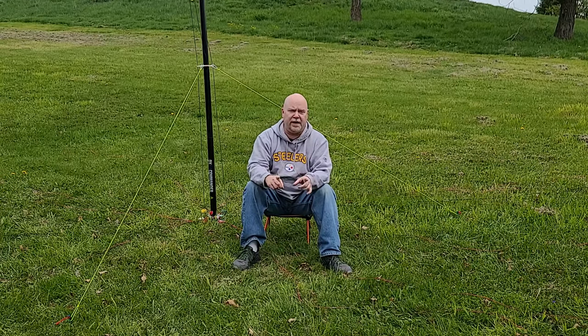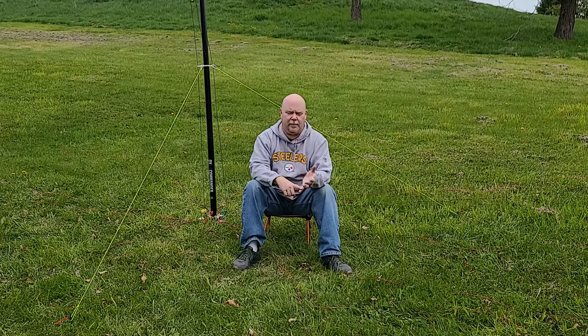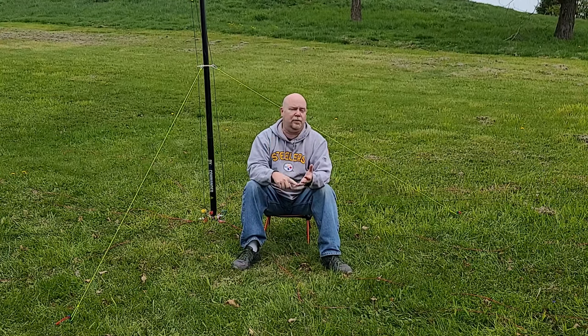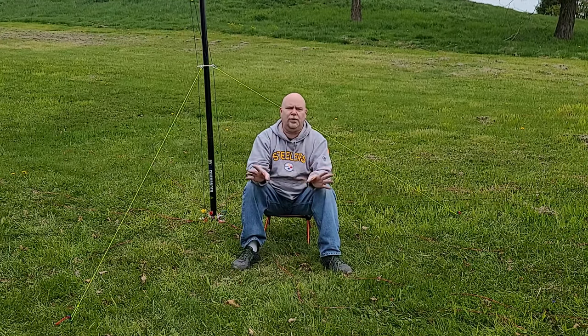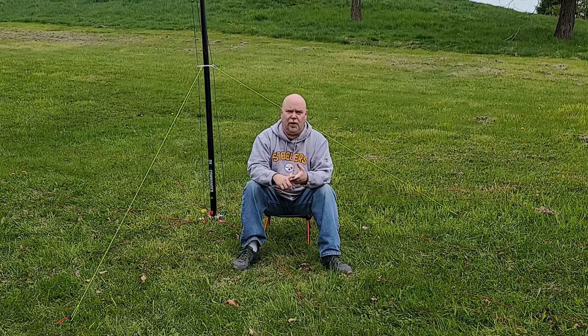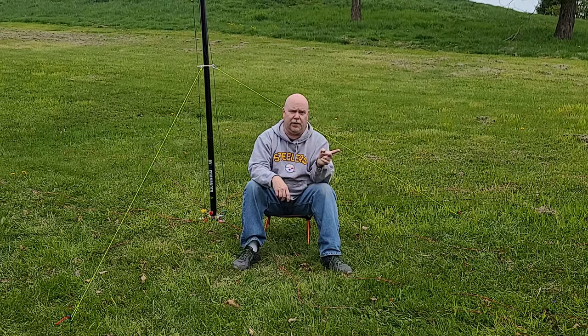It's just minutes. And what you get for that is a full size quarter wave on a whole bunch of different bands. As set up here, I can run 40, 30, 20, and 15, the entire band with no tuner. I've got a full quarter wave on 40, 30, and 20, and a 5/8 wave on 15 meters. So this is a very efficient antenna with a great low takeoff angle that is going to get absolutely the most performance out of my little QRP rig over there.